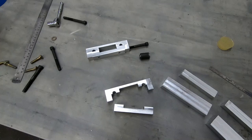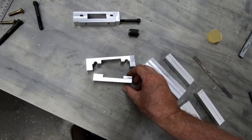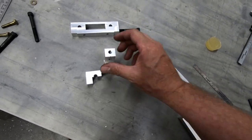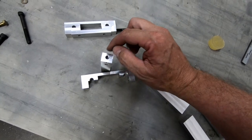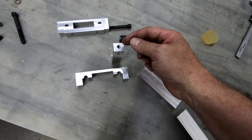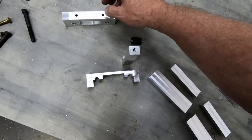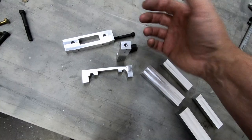It's only 2 millimeters, but I think it's going to make enough of a difference because these tolerances are pretty tight. Now, the one thing I was concerned about, one of the reasons I lowered that bolt a little bit, is that the edge distance between the top edge here, so between this edge and where the threads go in, is pretty close tolerance. On the drawings, it's actually quite close. Even these bolts here that go through are really close to the inside edge of this bracket here.